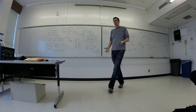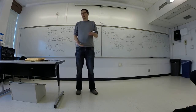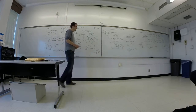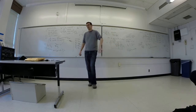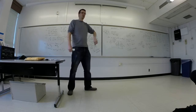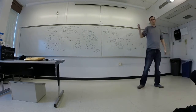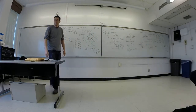So that's when you really have to be watching yourself, is when you accidentally hook up an ammeter, which is a very low resistance, because you're supposed to put it in series with things, and you accidentally connect it like that. All right? So if you're going to make a mistake, put a voltmeter accidentally in series. That just brings the current way down. You have a huge wrecking ball, but in the safe direction. If you do the other mistake, you put an ammeter in parallel, you're going to get a massive current surge. Okay? Are there any questions on that?